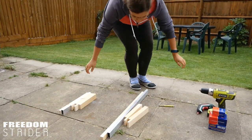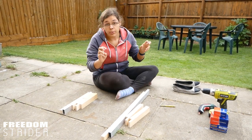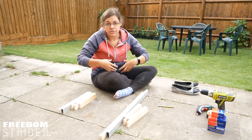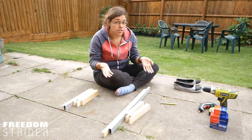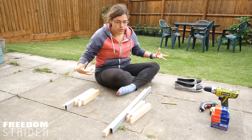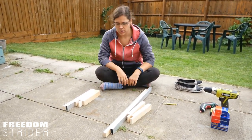Alrighty. So for the pull-out bit, we need to construct the pull-out legs. Obviously once the slats pull out, they either have to have some sturdy legs and framing to rest on, or you could use runners. Now, we can't use heavy-duty runners because of our couch depth, so we're gonna have to construct legs for the bed to actually be a bed and not just on the floor.